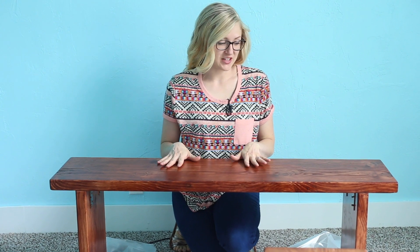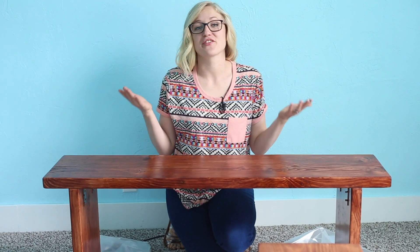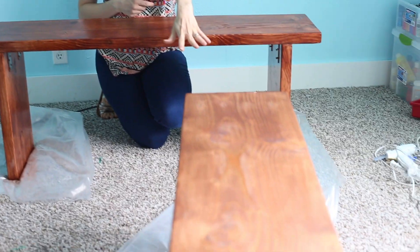I stayed up last night and put on a second coat on the bench I did yesterday, and it's still a tiny bit sticky to the touch, so I'm going to let it dry longer. On my second bench over here, I have one layer of the polyurethane — I still need to put on a second layer. I also made sure to cut off a little bit of the bottom on one bench since it was a little bit extra tall; I'm going to secure that one to the wall as the kids' bench since it fits them better. I cut off an inch and a half from the other bench so it can accommodate the adults on the other side of the table. All that needs to happen now is another coat if I want it darker, or just let it dry until it's not sticky anymore. I'm so excited for this to be all the way dry — I can't wait to start using it in our kitchen and having our kids make memories on it.